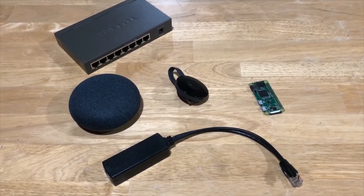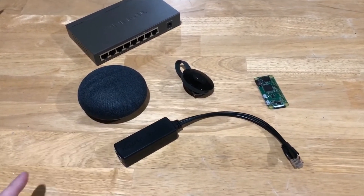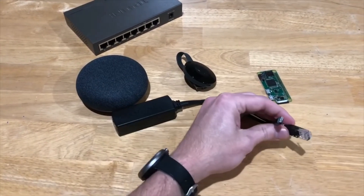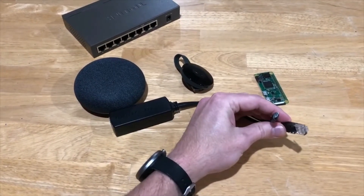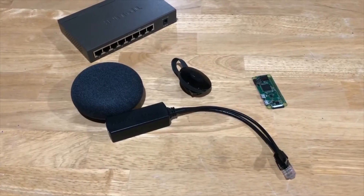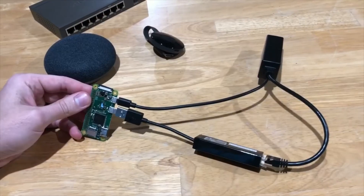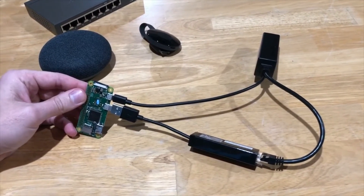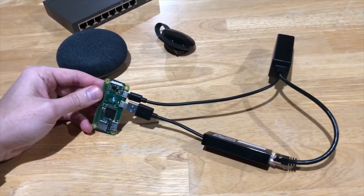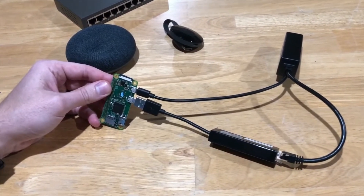Some of you may be familiar that this is already possible with something like a PoE splitter here, that will take a PoE jack in to one side and then split it out between an Ethernet and a micro USB delivering power. However, this adapter does it all in one without having to split it out. With the PoE splitter you end up with two cords, which means you end up using both ports on your Raspberry Pi, and it also requires an additional adapter to convert the Ethernet back down to a micro USB.